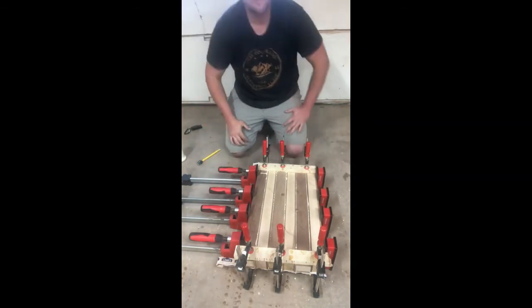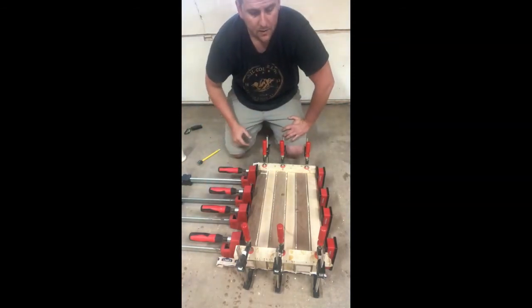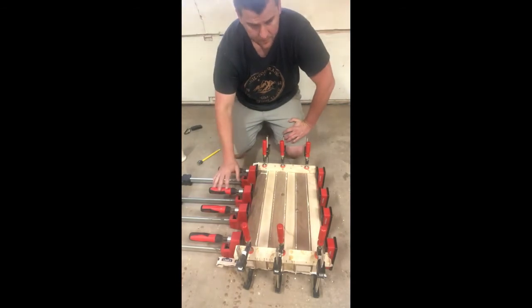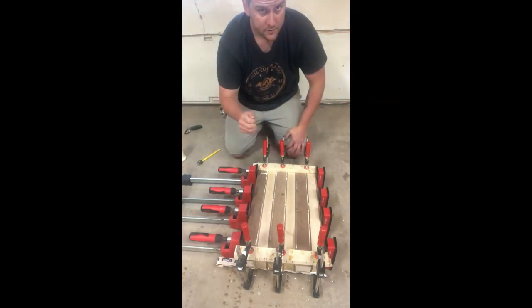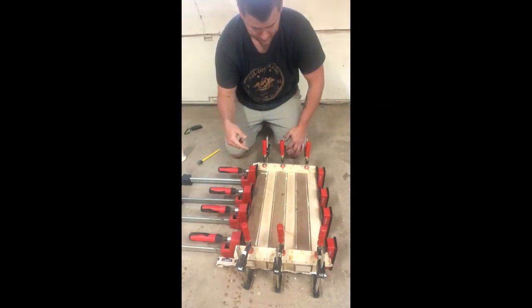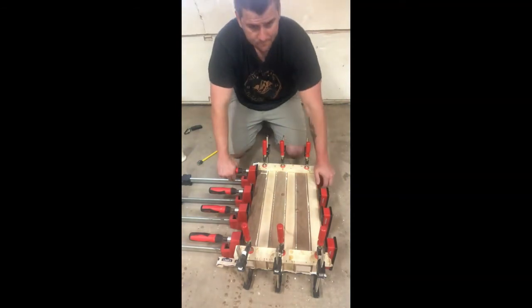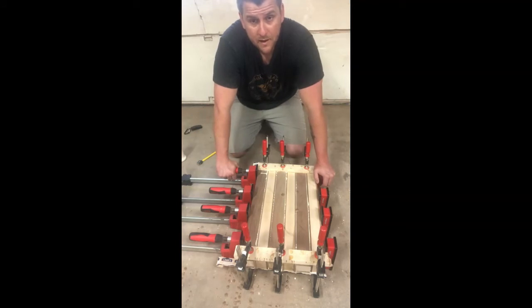So like I said, leave it for 30 minutes. I'm gonna come back, take these off, scrape the glue. 30 minutes later, I'll release the big clamps, flip it over, scrape the glue, put it back in the clamps. Just put a little pressure on just to keep it, I guess, for my own peace of mind, and leave it for tomorrow. Okay? Okay, day 3.